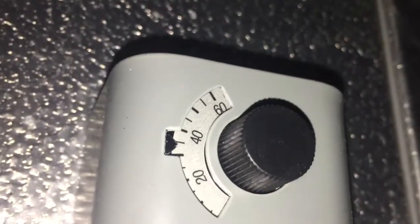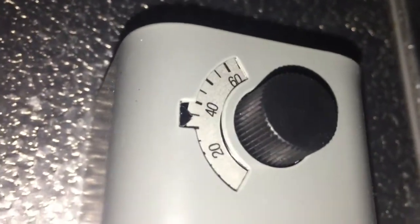That energized the solenoid. It's set at 35, but they're saying it's just not maintaining 40, so that might just be a calibration issue with the thermostat. That's why I don't like these mechanical thermostats — you can't really see what temperature you've got. I'd much rather have a digital one here, it's more accurate.